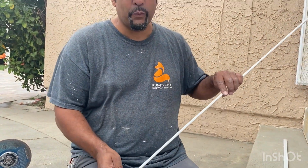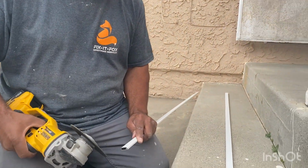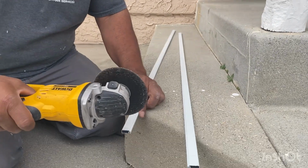There we have it. Okay, we're back outside because some of you might have even caught this when you're watching it. I ended up putting the frame into the window to try and dry fit it, and I realized it's way too long, way too tall. So I redid my calculations and I realized that when I took, I think it was 58 and an eighth, and I subtracted an inch and a half, I came up with 57 and 5/8. It should have been 56 and 5/8. So I remeasured and I'm ready to cut again, and hopefully this time we'll get the right size frame.